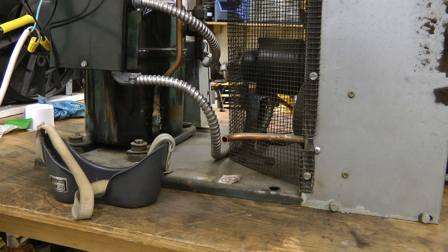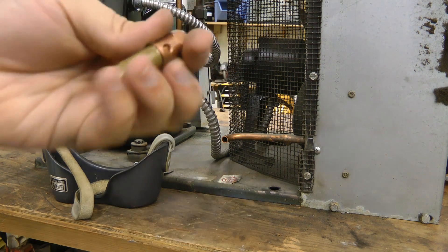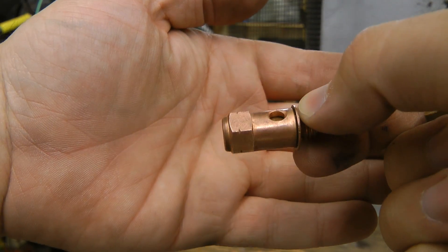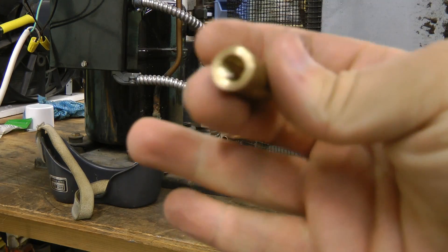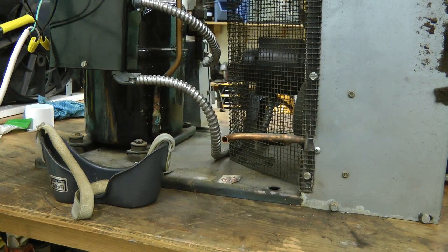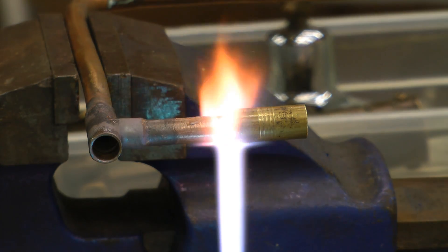Now that we've got some tubing, we can make it a little bit easier. I've got a little piece to attach this pressure relief valve. This part is actually a pressure relief valve from an old refrigeration compressor — I think this goes off at about 450 psi, so that'll be appropriate. This is a simple adapter I machined up on the drill press. Let's braze this onto the tubing we just took off. Since this is brass, I'm using a 45% silver brazing material and flux. It's a little bit difficult to do without melting, so wish me luck.